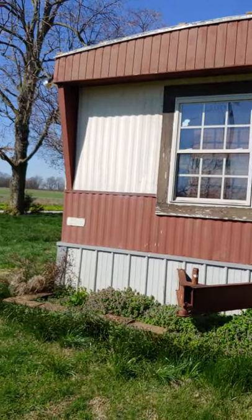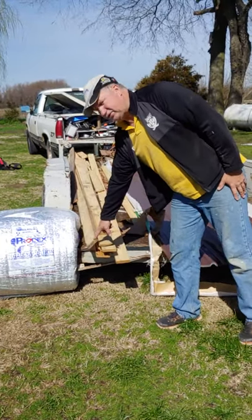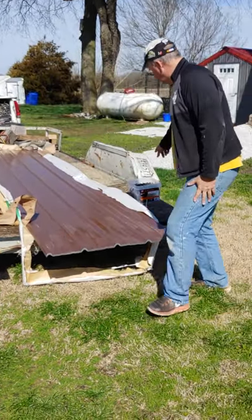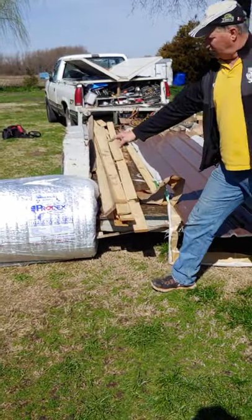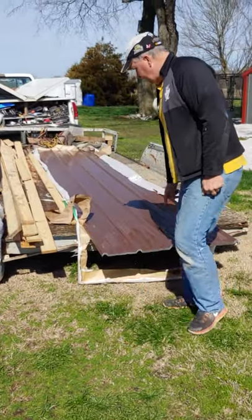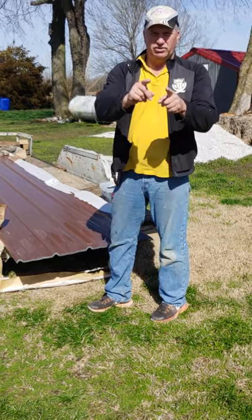You can do a metal roof on a rounded roof mobile home — I'll show you how. You're going to use 1x4s that are 16 foot long, though you can use shorter. Fasten with 3-inch screws through the metal into the rafters. Then you're going to put insulation — this is called Prodex — and then metal roofing that goes the whole length. I'll show you that.